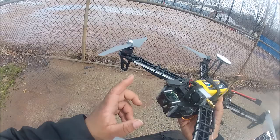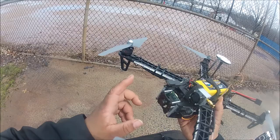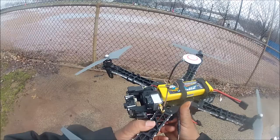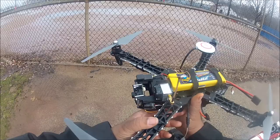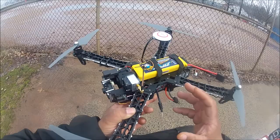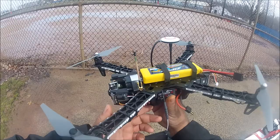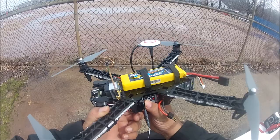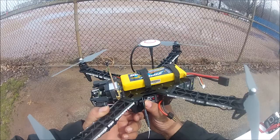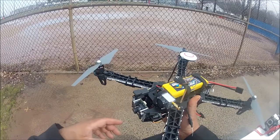The camera switch is paired together with the LED light switch. When I use the main camera — camera one — the LED lights won't be on. When I switch to either the front low-light camera or the rear camera, since those are the night-time low-light sensitive cameras, the LED lights will turn on automatically. It makes logical sense the way I set it up. That way I managed to squeeze use out of a nine-channel receiver — I wish I had more channels, but I prefer the HiTec for its features and functionality over having more channels with fewer features.